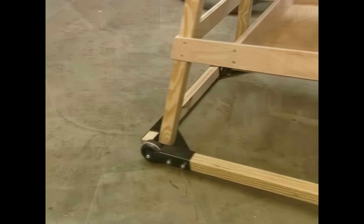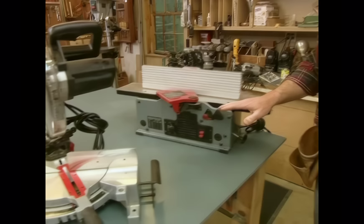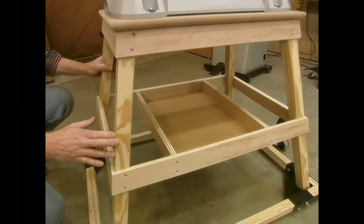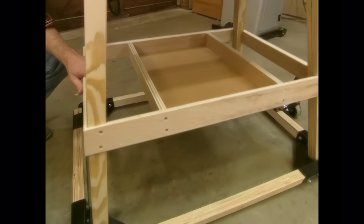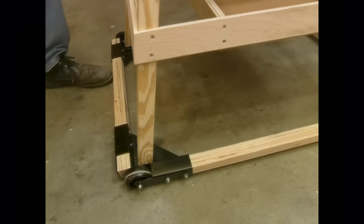And there's more. How about one of these? A mobile tool stand — a place to set up your bench top tools, like this surface planer, or perhaps a small joiner, a chop saw, even a small drill press or band saw. This one is made of off-the-shelf materials. The top is 16 by 24, and it's about 30 inches high, but it could be expanded to any size. The key is to have the legs splay out to give the stand a lot of stability. I added this little storage tray, because bench top tools often have accessories you need to have close by. For the mobile base, the casters are commercially available with brackets, and I use my own lumber to make one exactly the size I want.